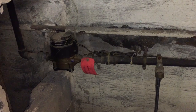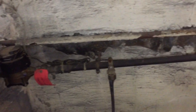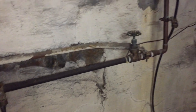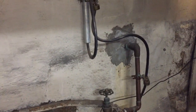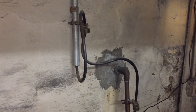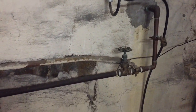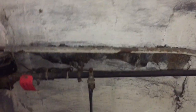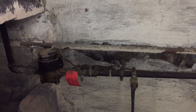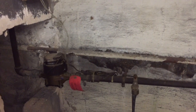Also, the EMT that was used — I'm assuming to protect the grounding electrode conductor — does not look like it's properly bonded in accordance with 250.64e1. It looks like something got changed, maybe the piping got changed, because those clamps are really for a raceway, not just a conductor. In any case, there are a few problems with this grounding electrode conductor installation.